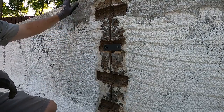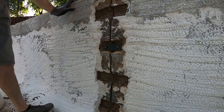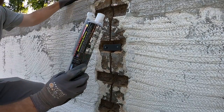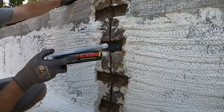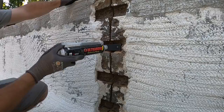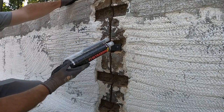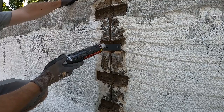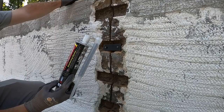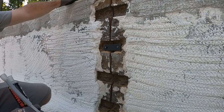It's getting later in the evening, so I don't know if we'll do the epoxy tonight or tomorrow morning. But the next step is to take that two-part epoxy, clean out the drill holes, fill them up, insert the studs and the plate, being careful not to get any epoxy on the plate because as we tighten this thing up, the plate needs to be able to move — as does the cam on the stud. I'll get the rest of these holes drilled and we'll pick it back up for that next step.